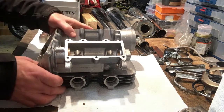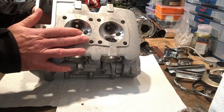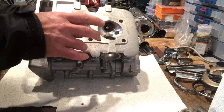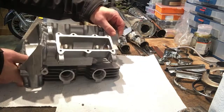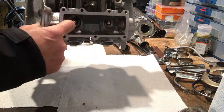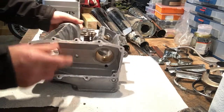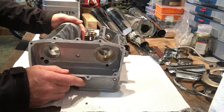So the first thing that we'd noticed was that the domes hadn't been machined. And then when we started to look closely, obviously there were no valve seats in it. And then we realized that the channels for the valve guides and also for the valve tappet buckets down here, they hadn't been machined or line machined. Then we realized that on the cam chain side of it, some of the oilways hadn't been drilled, and the oiling system,